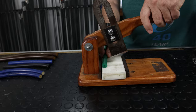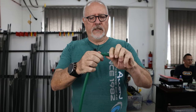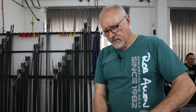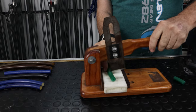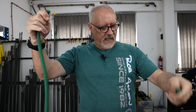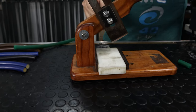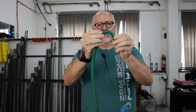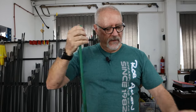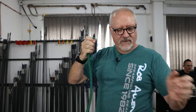I'm going to cut about halfway through — it's a little bit more than half. Looking at it already, it tears extremely easily. Let me cut a little less — that's about halfway. Again, pretty much no effort. Cut even less — maybe a third — again the notch toughness is extremely poor. Let me try a tiny little cut. A little bit more effort, but to be able to break it with one hand is not a good thing.